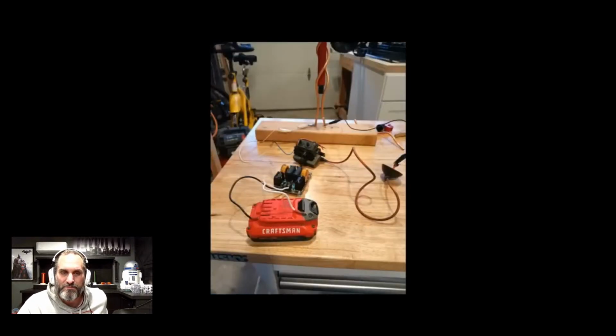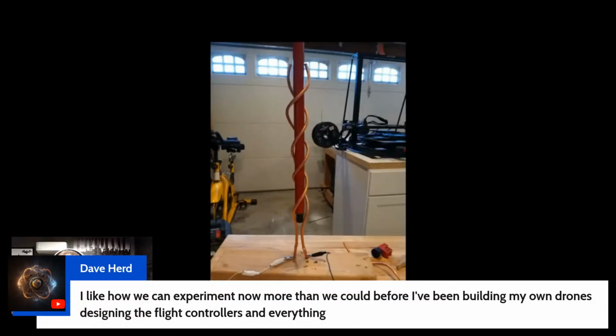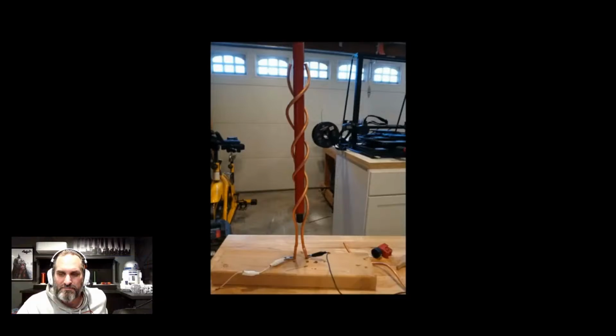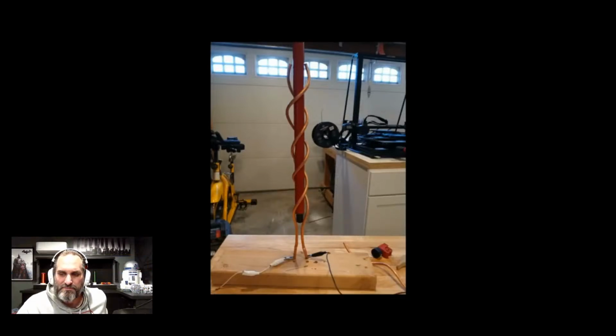I'm also using a flyback DC transformer, and then the actual metal here is just twisted around a pole. As you can see, you do one and then the other, one then the other, all the way up, just like you're braiding, and it comes out pretty cool. You get it to the top, and you'll have to adjust it a little to make the breakout point where they don't touch right away. At the bottom, you need to bring it in close enough that they touch enough, but still let the thing drive forward and go up.